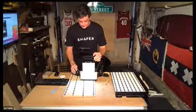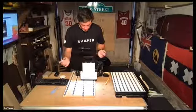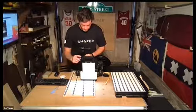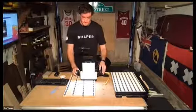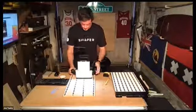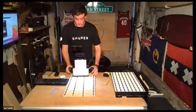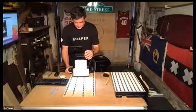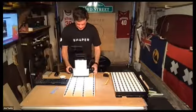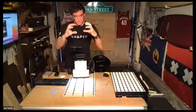All of those are available for free. You get it accessible on-tool by hitting 'sync to Origin.' I'm signed into the same Shaper Hub account on the tool, which is ideally always connected to Wi-Fi. Back on the tool in the design stage, if we want to access files from the Shaper Hub, we select 'import.' Here are all the cut files I've selected. Under 'butterfly inlays' I've got 15 different styles. I'll select one, rotate it 90 degrees, and place it right over that crack — and it lives there until I pull the tape up.